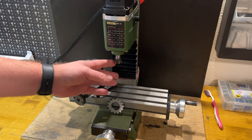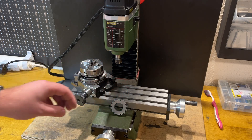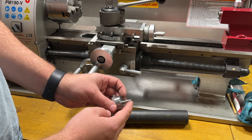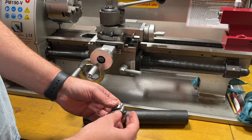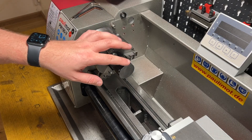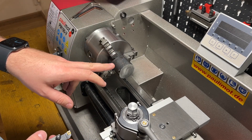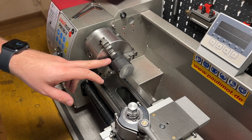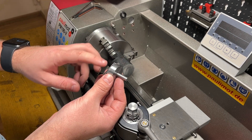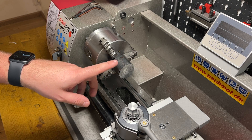Making the holder should be a quite easy task. I will just take a piece of steel and do the holder. I'll start from this stock material, clean it up, and then rotate it. In one installation I want to do the shaft on this side, and most importantly the place for the cutter, so that the cutter is completely aligned with the shaft.